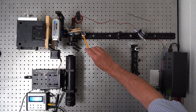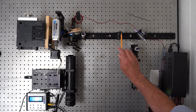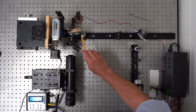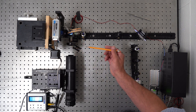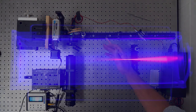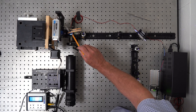The next two lenses here operate like a reverse telescope — it makes the image smaller. They're spherical: one is 65 millimeter and one is 25 millimeter, and they focus exactly down at the rear focus of this objective. A lot of people think it makes a perfectly straight flat line, but that's not true — it does focus down in a sheet, but the place where it focuses is very small.